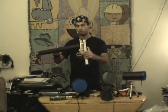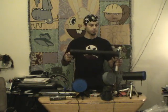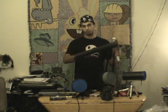Now, if you really want to do really long-range shootouts, use two helical antennas that are polarized in the same direction, either left-hand coil or right-hand coil, the actual driven element, the actual receiving spiral of wire. Watch the segment and you'll understand. The reason is, instead of being horizontally or vertically polarized, it's circular polarized in the exact same phase no matter what. So you don't have to worry about the signal reflecting or bouncing off of anything. And because only those two signals on that frequency are rotating in the same direction, they'll really only want to see each other rather than everything around them.